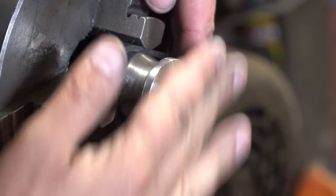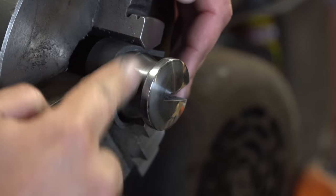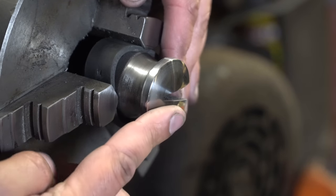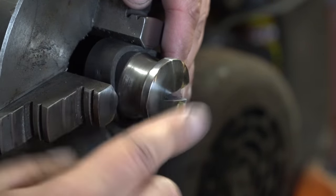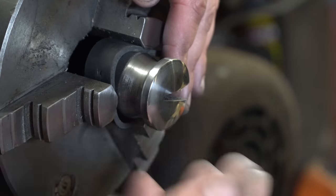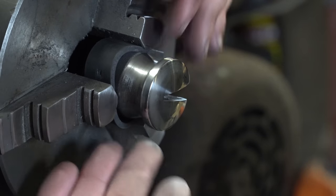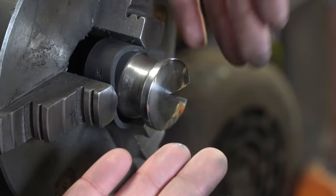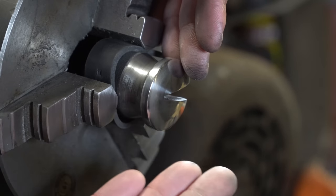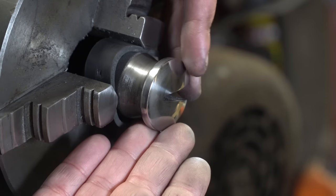Okay, after heat treating, I'm spending 97 years polishing this. We're almost there. But I do not need to temper this steel because it is 1144, which hardens to around 52 Rockwell, which is the perfect wrenchiness hardness. And that should suffice. Not to mention, it's also a stress-relieved steel, so it hasn't moved very much at all.